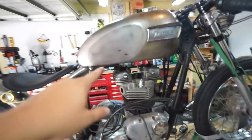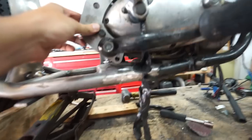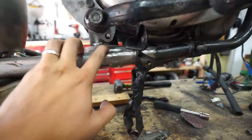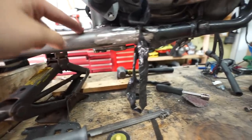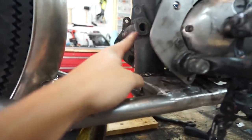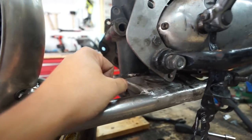Here's what I'm thinking. We have a really solid mount on the top, a through bolt with two mounts on each side — really solid in the front — and the big thick center-mounted mount in the middle and bottom. So this rear plate mount is really kind of redundant to me as far as mounts go. I have this open hole down here at the bottom of the plate. What I think I'm going to do is just fabricate a nice thick tab, weld it right here on top of the frame rail so the weight will be directly in the middle of this tube, then have it just bolt right through this bottom bolt hole. That will be really clean. And then I can actually chop this whole thing off and have that be nice and clean as well.